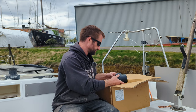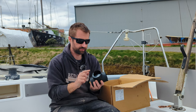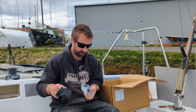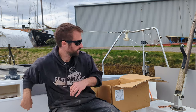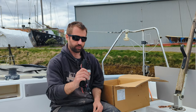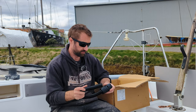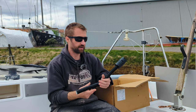Let me get this bit out of it first. We've got a plastic T piece, which, assuming it's rated for the heat, I probably will end up using, because why not, it comes with it, and it's plastic, so it's not going to rot in the marine environment. Little fuel pump, that's what delivers the diesel to the heater. Wiring loom for connecting up the heater, as well as the control panel and all that, and the 12 volt supply for the fan and things. This is the air intake, so this is not the air intake for the actual air blower, but for the fuel system.